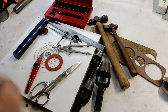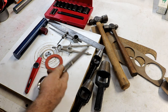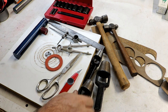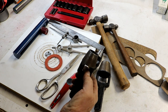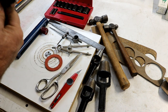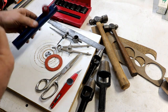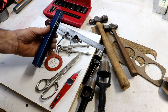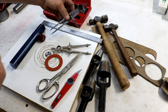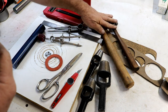A quick rundown of some of the tools of the trade here. We have cutting tools — scissors work great, and a sharp knife. We have arch punches — that's arch as in A-R-C-H punches — and here's a versatile set of arch punches. A gasket cutter that will cut circles and radiuses. Measuring tools, and that includes dividers and compasses. And then hammers — ball peen hammers.